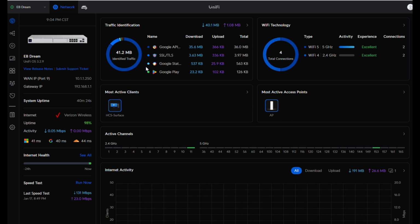I see a lot of them deploying their own little mesh networks or partnering with third-party people to have mesh networks in houses. And mesh is fine, but if you're building it, guys, put the wires in place. You don't have to do access points day one, but you may decide that the mesh just isn't cutting it. And if you have the wires in place, you can move to something like this anytime down the road, and it's super, super easy.